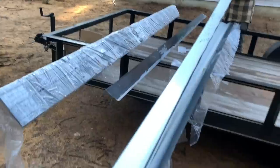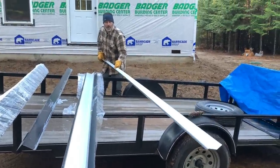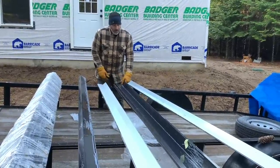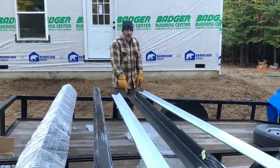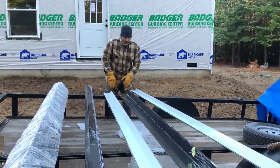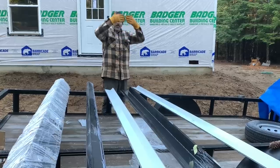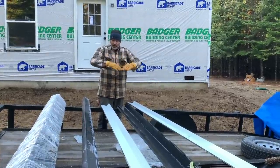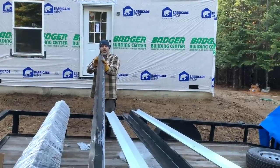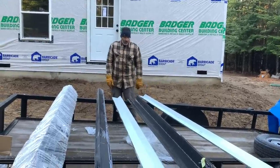No, that's not the same angle. This is like a big puzzle. I know what they are — this one is for the wall on the dormer. It comes down the wall and then extends out over it. This one is for the front of the dormer — it comes down and then goes at an angle to cover the roof there. This one, almost at a 90, is the drip edge for the dormer. These others are the drip edge for the rest of the roof.